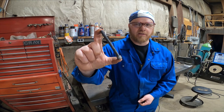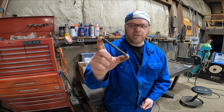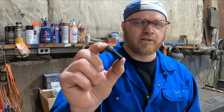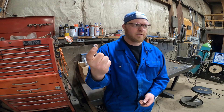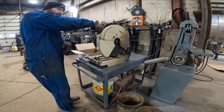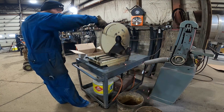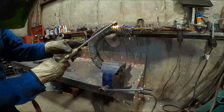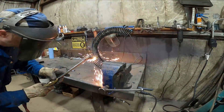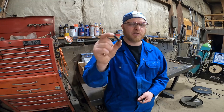These are the standard center bolts we use in Chevy pickup trucks and all sorts of different vehicles, and I get them from my normal supply — relatively cheap. I priced out pre-cut versions before I started and they were 30% more, so I decided to just cut these down. However, cutting them with the chop saw was proving counterproductive because it would leave a little burr, requiring a trip to the bench grinder. Then we tried a method which was welding them all together and cutting them with a torch — it didn't really save any time but it was fun to try. After all that, it's by far easier to just buy little nubs, purchase them, put them in, and weld them in.